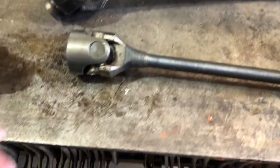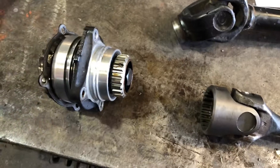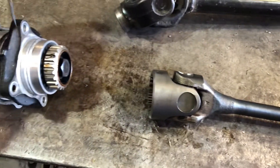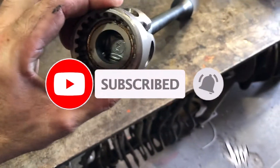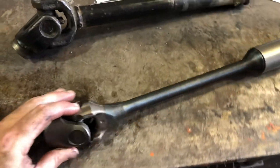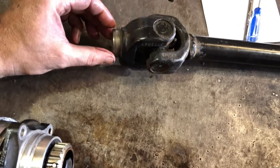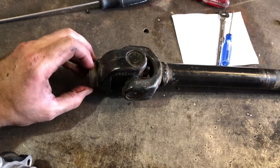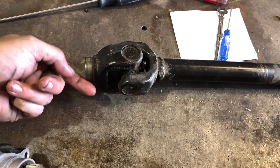We're going to ditch this completely, but what I'd really like is that you push this little spring, which is like that, and this comes off. I really like this idea. We are going to machine out this inner diameter so this yoke can then slip into it. We are going to put a few keyways or machine something in to give it some rigidity, and then we are going to TIG weld all the way around this yoke.